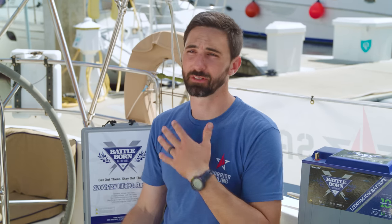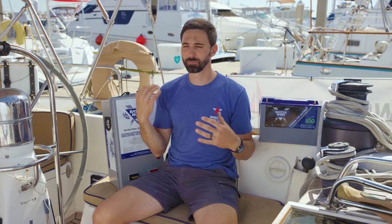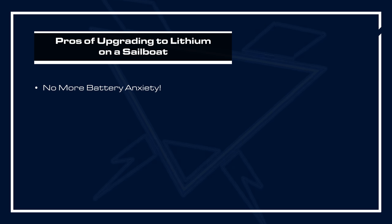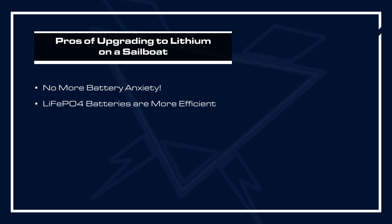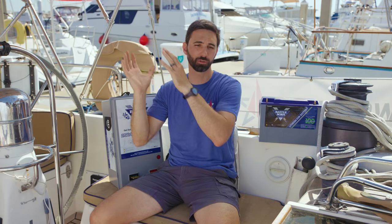Some great pros after personally living with lead acid batteries for so long: it reduces battery anxiety. I used to constantly monitor the battery state of charge, trying to always get the batteries to fully recharge each day — guessing how sunny it was going to be, when to run the generator. It was a constant thought. These batteries are happy living in partial state of charge levels. Another pro is that Lithium Iron Phosphate batteries are more efficient. With a lead acid battery, you have to put more power into it than you took out to fully recharge it. Whereas a lithium iron phosphate battery is almost 99% efficient, requiring a lot less energy to fully recharge after discharge. So if you have solar, you're able to put more of that power into recharging the battery as opposed to generating heat.